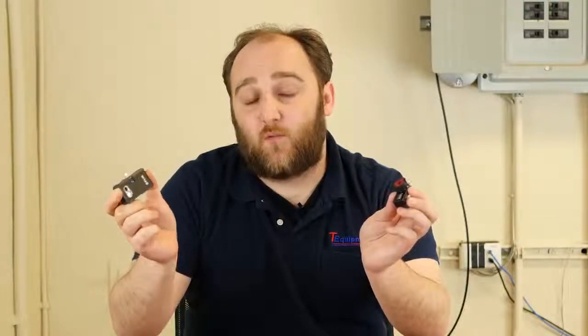So that's the FLIR One and the Seek Thermal. Both of these Pro models are great for most applications, but they have their differences. Another thing to keep in mind is that FLIR images are fully radiometric and can be exported into the FLIR Tools app for later analysis and professional reporting. Seek doesn't have a complementary software suite. So if you need to submit a report and you're deciding between these two, I definitely recommend the FLIR.